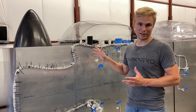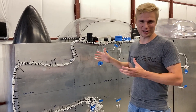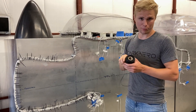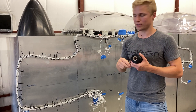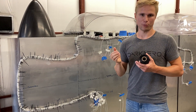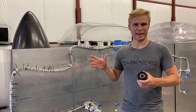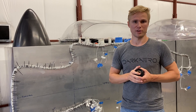The wiring harness is now at a near-complete state — there are a few more wires to add but it's essentially done. It's pretty messy with all the zip ties right now, so we're going to clean it up and replace them with wire lacing. For those who don't know, wire lacing is a high-temperature aircraft-rated string you use to tie loops around your wire bundle — same function as a zip tie, but it's less abrasive against the wiring under vibration conditions. After the wire lacing is installed we'll have a complete harness, but we'll also need to install wire holders inside the airframe before we drop it in. Hope you like the update — more content coming in August, so stay tuned and we'll see you in the next one.